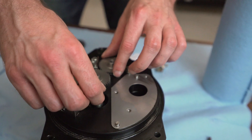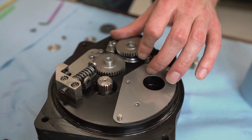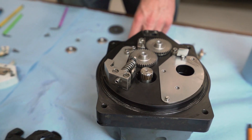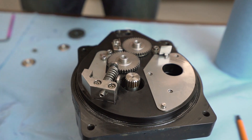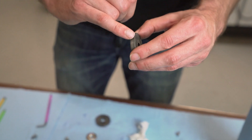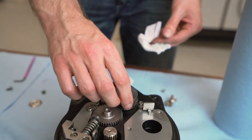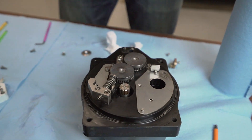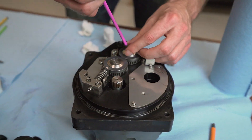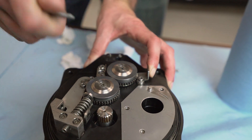Notice how the gear here controls this shaft, which rotates one gear and then the other. If wire gets wrapped around those it'll cause friction, which can lead to wire breaks. Eventually the pinch rollers will get worn out — you can see the wear mark from the wire — and eventually they need to be replaced. Or you can flip them over and get more life out of them.